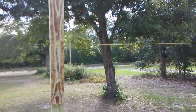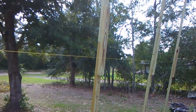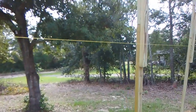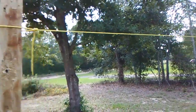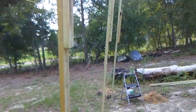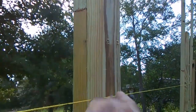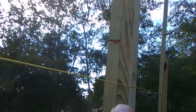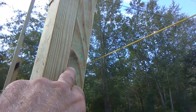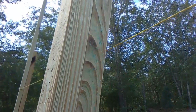This will be a short little segment. I've got my combined two eight-foot two-by-fours in the ground. To get those poles level, right at the eight-foot mark you just take a string and tie it all the way across to the other one, then dig your holes until your line gets level. As you can see, this one's got to go down more, and same thing on this one — it's got to come down some more. That's how you get your holes dug so the poles are level and sticking up the same height all the way across.